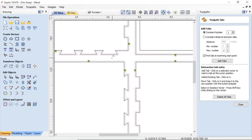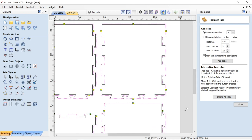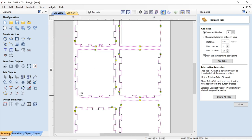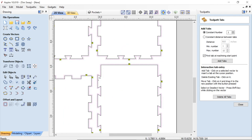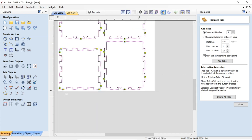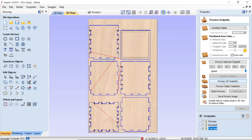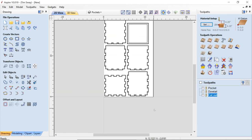The box is done — I could just go cut it on my CNC machine. However, I wanted to change the tabs around that it created automatically because some of them were on inside points. So I moved them all to the outside points, which would make them easier to sand off later. When they're on the inside I'd have to get in with a small piece of sandpaper or a file, but if I move them all to the outer edge I can just run them across a flat sanding surface on my workbench. The gadget takes care of all the math and all the cutting tool paths. One thing you do need to do is start your file on the bottom left corner, because it automatically defaults to that pattern — otherwise it'll shift everything to the upper right-hand side.